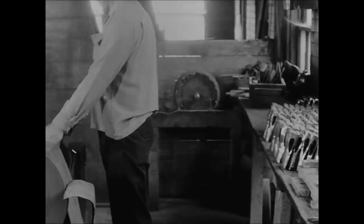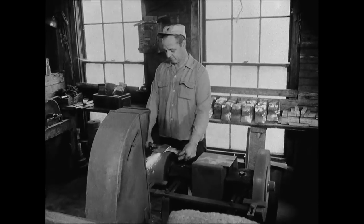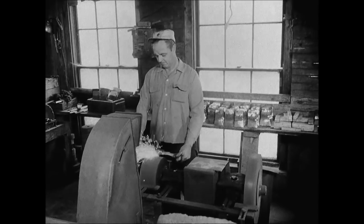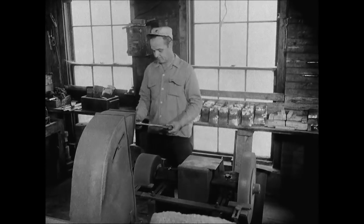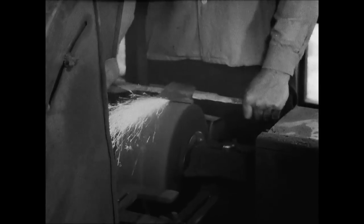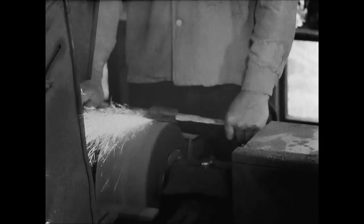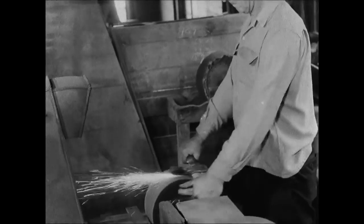These axes, the products of craftsmanship in forging, grinding, and tempering, now await only the refinements of final grinding, paint and label, and the application of a handle before they are ready for purchase. Wood removes all rough edges, the marks of earlier raising, puts the final edge on the bit, and polishes up the bit about 3 inches. The skill of his hand has been an important part of the creation of these axes, from the raw steel bar to the glittering finished blade.